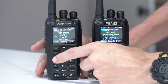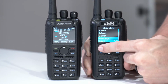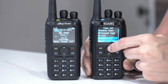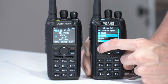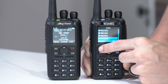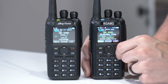Now, if you wanted to, let me give you an example real quick of changing the tone. So just to show you what that tone will do for you. If I go in here and we change the channel set and we change one of the tones. So let's say we change the receive tone to something completely different. We'll put this at like 192.8 hertz. Perfect. So now we're over here.